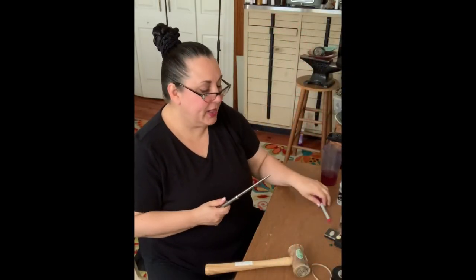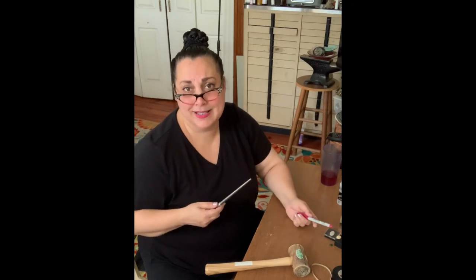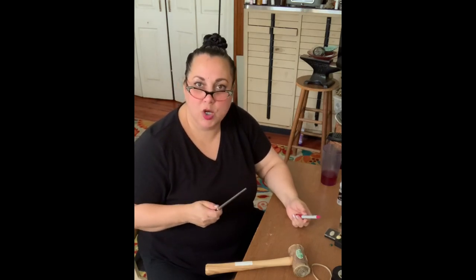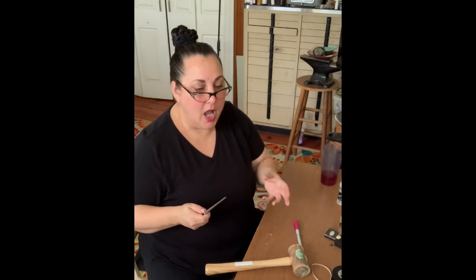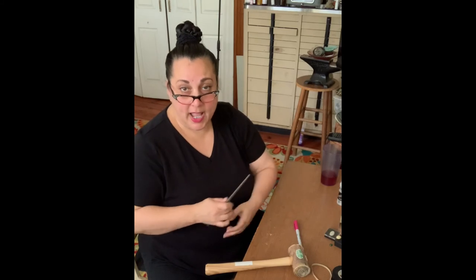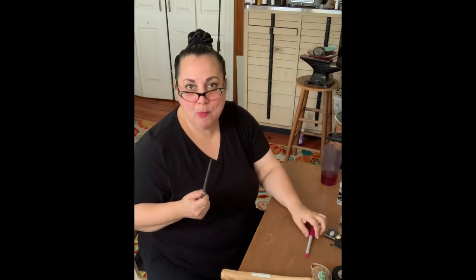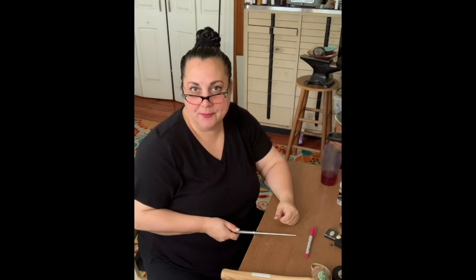It's low-tech, and the great thing about these magic markers is they rub right off. You could use an alcohol wipe to remove it immediately, but honestly most of the time I just leave it and it wears off with your finger. Take the guesswork out of these things: stretch a little bit, mark where you've stretched to, check it on the stone, and if that's not enough do a little more. Use your high-tech equipment — your magic marker and your magic eyeballs — mark as you're stretching, brace it up against the bench, whack downward, and you'll be shocked. You'll be stretching everything like that. That's it for today.